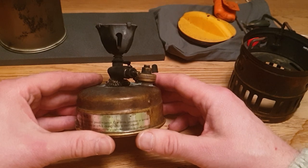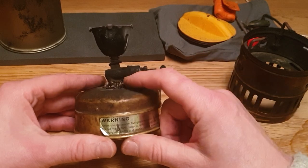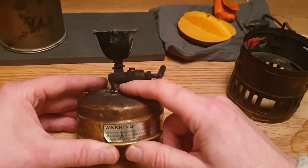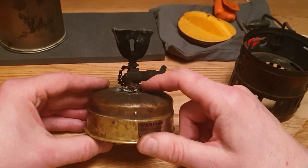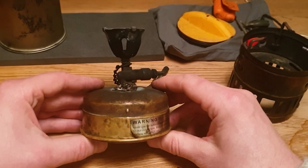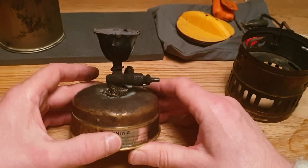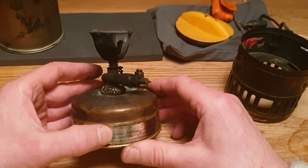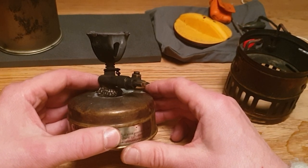I made a small modification on it. As you see here, I put in a fiberglass rope gasket from my wood oven back home, just attached it with a wire inside and knitted it on. It makes the preheating much less messy and the burn time much longer from the preheating, so it will get warmer.